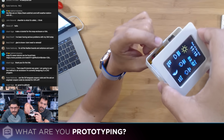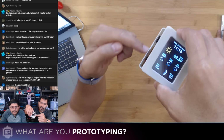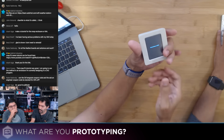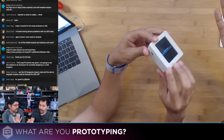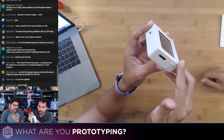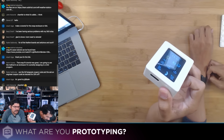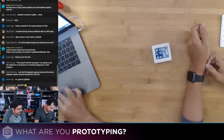And then this little part right here holds it on there. So you can either do a small little part of it, or you can make it the entire width or radius of the whole case. So we've done both, and it just depends on the way the case is designed or the use case for it. For this specific one, the display is flush with the PCB, so I couldn't have a lip around there unless I increase the overall size of it. So I do have this opening lip for the screen to be flush with it. So it worked out well. Also, the standoffs were kind of in the way of the display, so I had to make some of these little cuts and stuff.